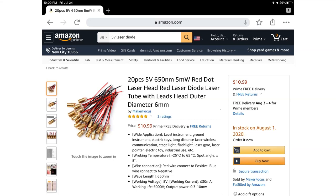I ordered the lasers and found only six of the ten fired at the same intensity. So I ordered 20 more, figuring I'd get 12 good ones with spares. For the framework, I considered designs using wood with T-tracks, but the cost wasn't much cheaper than using plain aluminum extrusions. I finalized on OpenBuilds V-slot rails for the frame with 12 laser arms. Aluminum extrusions provide the best flexibility in framework design and ease of laser alignment and adjustment.